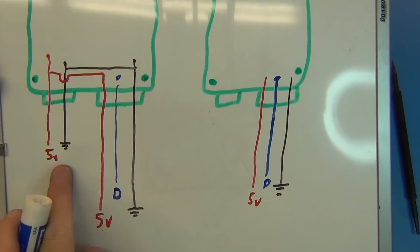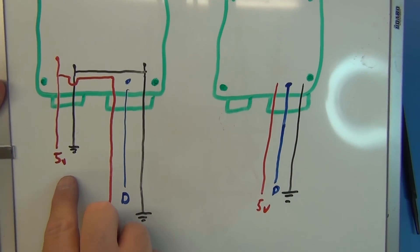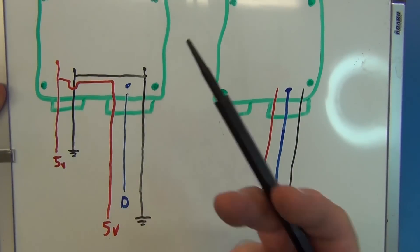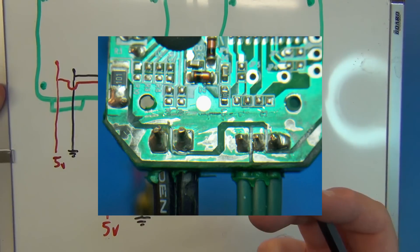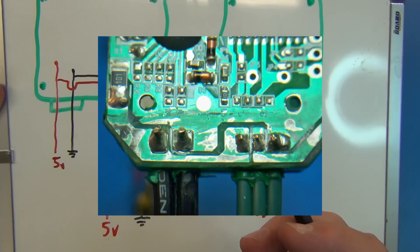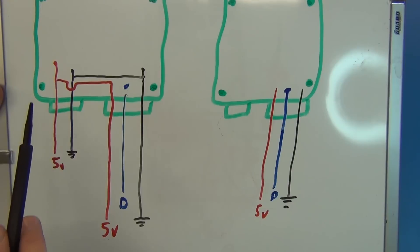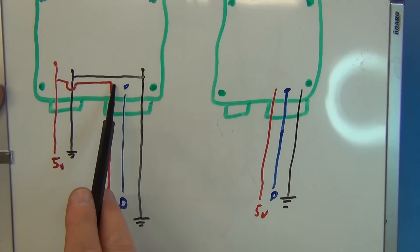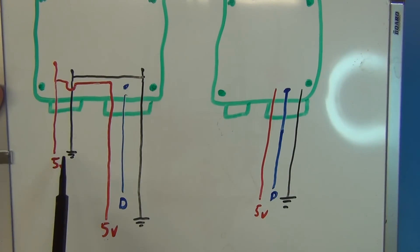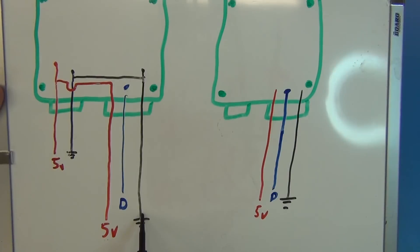I'm going to have to keep the power supply on both, so I didn't draw it over here. I put up a picture — a close-up from when I totally took these things apart in the previous review and really gutted into them to show the circuitry, and in that photo you can see the traces. Back here we see the same layout: positive coming in here, the trace giving five volts to the strand, and ground coming in from the transformer going out to the lights.